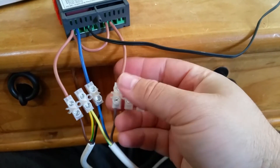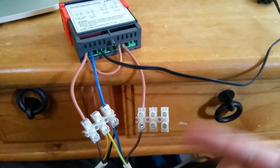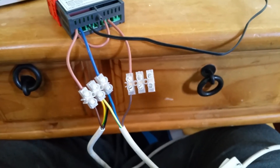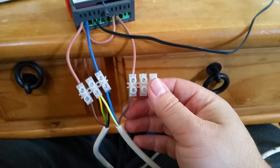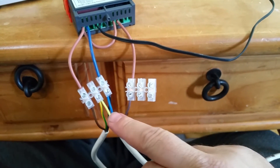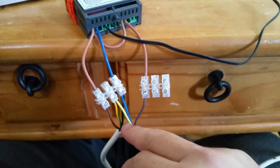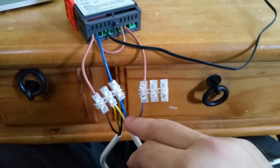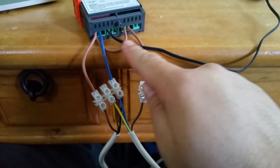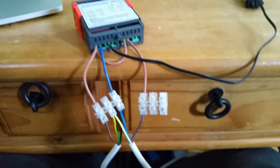It sends the live back to your power strip or your heaters — that's how it works. I don't need these two cooling ports; I could cut them or just put electrical tape on them. I'll find a box and set it up properly later. Basically another video enlightened me: all the grounds go together, all the neutrals get connected together along with one neutral for the controller, and then it's just the live that does this little trip — and with that it works.